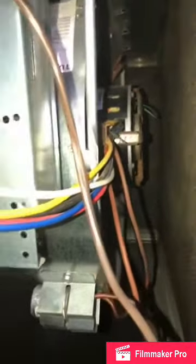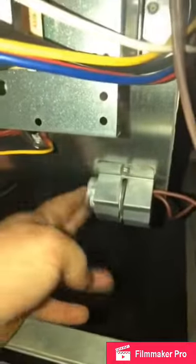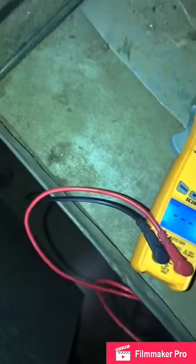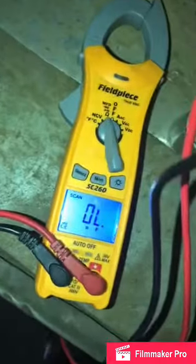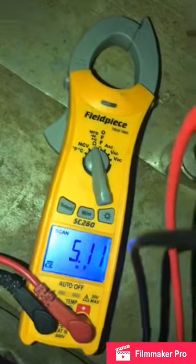You do have a capacitor to check. A capacitor gives it a little surge to start the motor spinning, and then the regular motor will catch itself and maintain the rotation — it's pretty much like a little kick start. This is a 5 MFD capacitor — micro farads. Switch your settings to MFD on your meter. You'll read open line at first then it goes to caps — 5.11, well within range. That's a good capacitor. Put that guy back and fire this heat up.